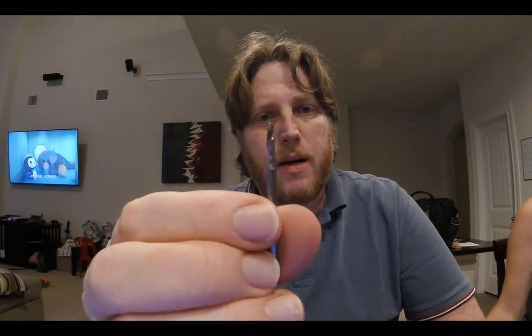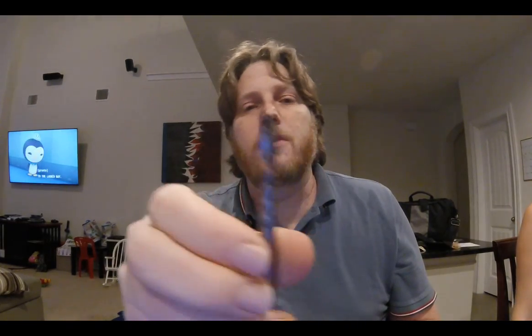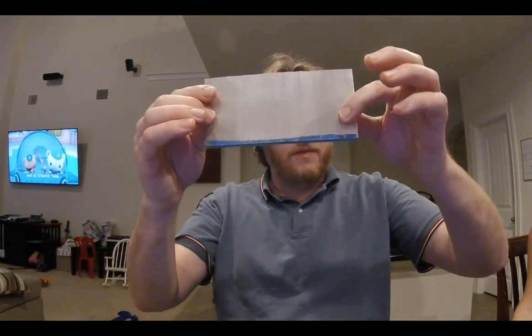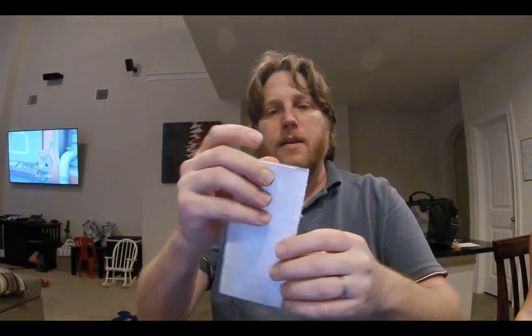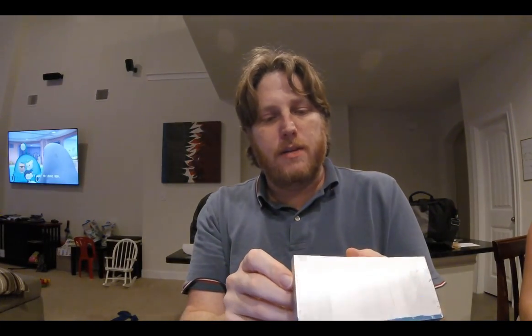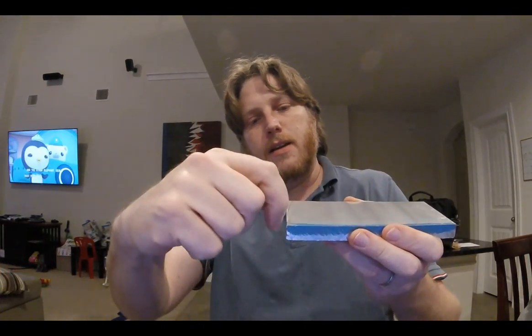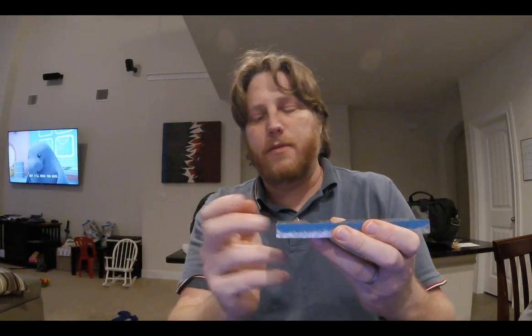This guy's also the same, 2/1000th minimum. And the quarter inch is supposed to be a chip load of 3 to 6. So the smaller ones are 2 to 4, the big ones 3 to 6. I'm going to be doing everything at 2. I have this piece of aluminum that I'm going to be testing on. I'm going to brace it down, and I'm going to do the zigzag test again, shamelessly stolen from watching John at NYCNC. And I'm just going to go back and forth, and I'm going to play with stuff around that chip load and hopefully not break a bit.